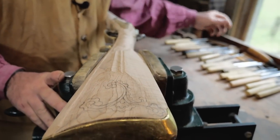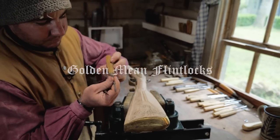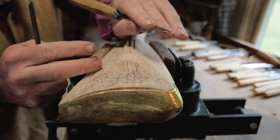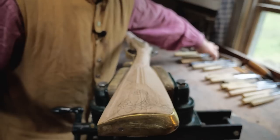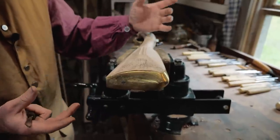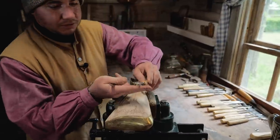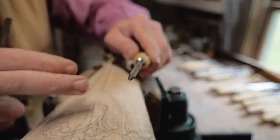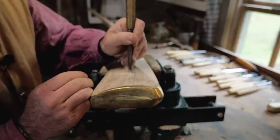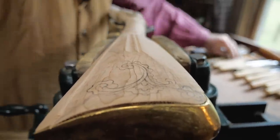I drew this pattern out — it's a simple pattern. There are a couple different ways to start. One way is to take a skew chisel and go around and dab in, cutting all the way around each line, then relieve the wood away from those lines — that's what raises the wood up. On this rifle I left about an eighth inch of wood sticking up above the butt plate. Most carvings in the 18th century were very shallow. We're going to do a stab-in method — you figure out what chisel fits the angle the best.